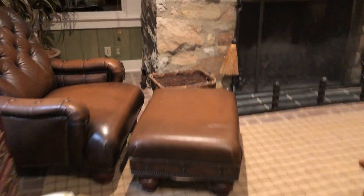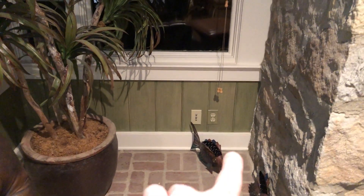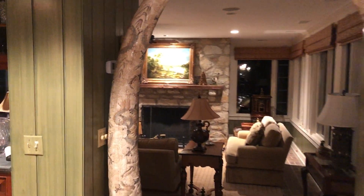Coming into the next room off the library, I need to get Wi-Fi in here. I could do a Beacon HD or a wireless bridge, but there is a phone jack over here. If it's wired like the others I've run into — a direct cable run to downstairs — I might put an In-Wall HD or an LR access point here. This house is basically a brick and chicken-wire build, so it's built like a tank: could survive three earthquakes and four tornadoes, but it absolutely absorbs Wi-Fi.